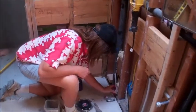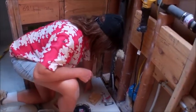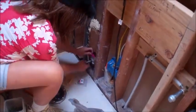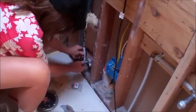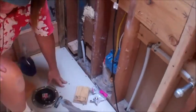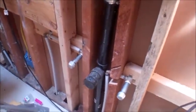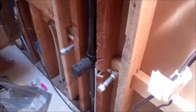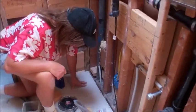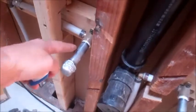She shut off the water and I'm just trying to get that built up so that it might be strong enough to hold it. I'm doing some figuring here — we'll go 90 degrees and secure it there. Looks pretty good. So we'll need all our PEX fittings, our compression, our copper rings, our good cutter to make the cut. We're going to need a 90-degree elbow and three PEX copper rings.